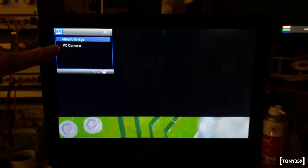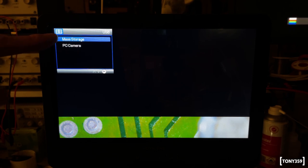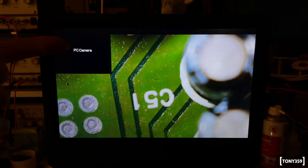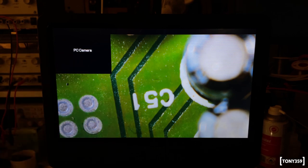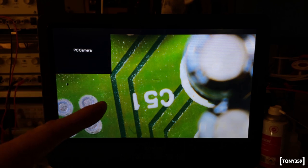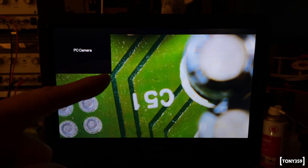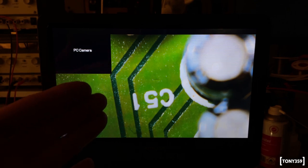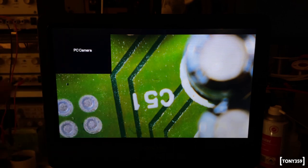Once you connect the Joya Lens to a computer, it asks whether you want to use it as mass storage — basically becoming a USB stick to access the SD card, which is pretty useful — or as a PC camera, which lets you use OBS as a USB microscope. Unfortunately, the moment you select PC camera, the screen turns off and displays 'PC camera.' You cannot see the picture on the screen and the computer at the same time, and the same applies to the external HDMI monitor. This is something the Lapson does better, as you can use the external monitor and USB computer connection simultaneously.